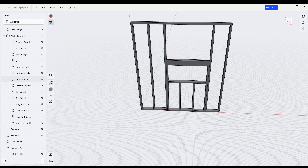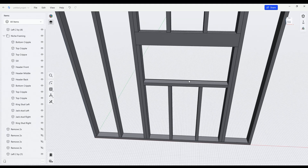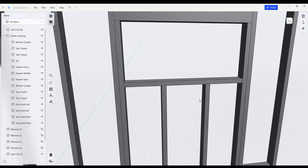It's worth mentioning here that these are all for the rough opening. Remember when building yours that the actual dimensions of your shelf will be about three quarters of an inch smaller in every dimension, because you need to account for a half inch backer board, mortar, and then tile. So plan to make your rough opening about an inch and a half larger than the finished opening will be.